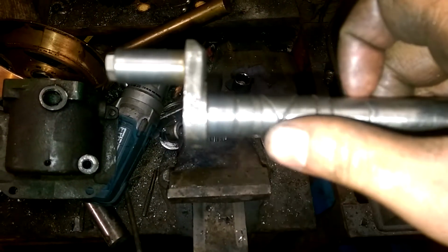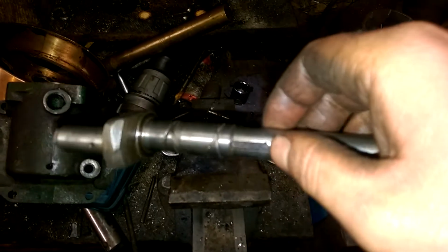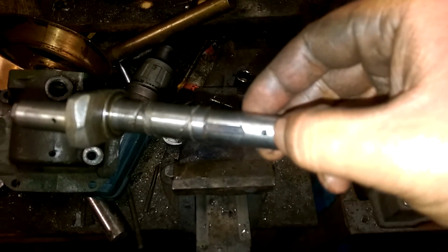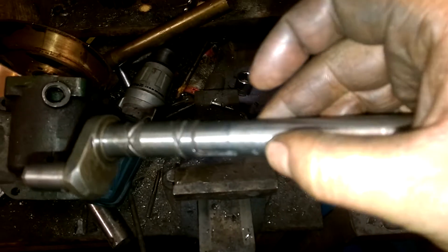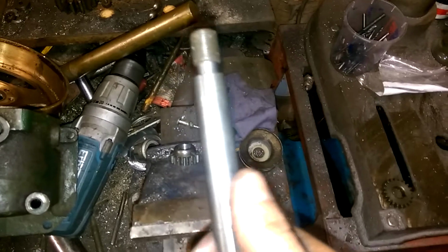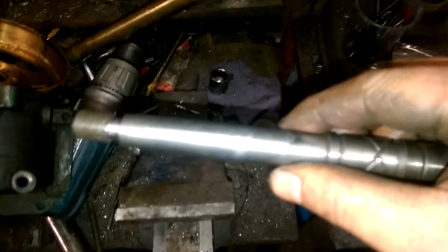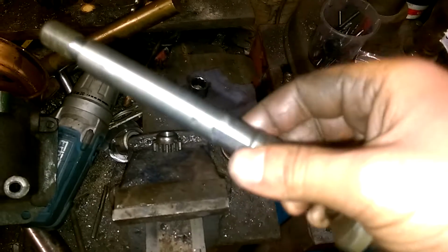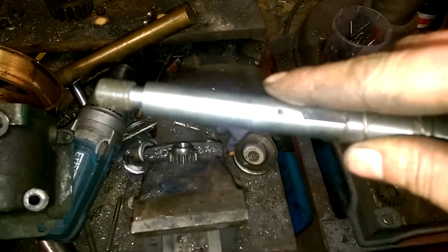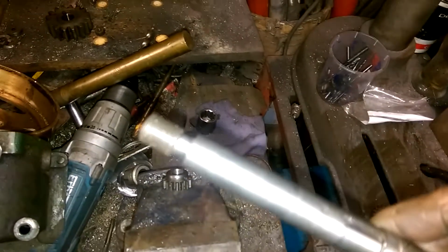Is the crankshaft. Originally this came along here, it's got a journal there with the grooves, the oil ways. Came up to the end of that keyway and then stuck out to about there with a 1/2" BSF thread. What I've done is I've cut the crankshaft off a scrap Villiers Mark 12, bored it, threaded it 1/2" BSF, screwed it on there, welded round, and I've turned and ground it back to the same size as that. It isn't perfect, but for the application of this engine it will do.